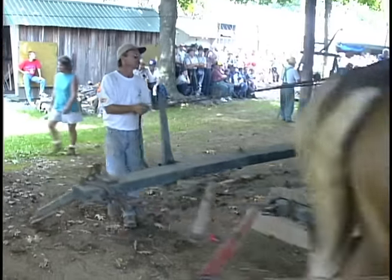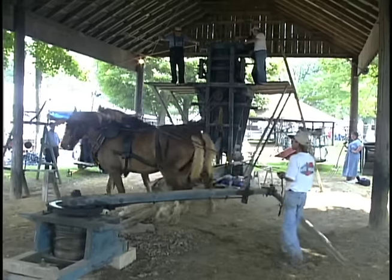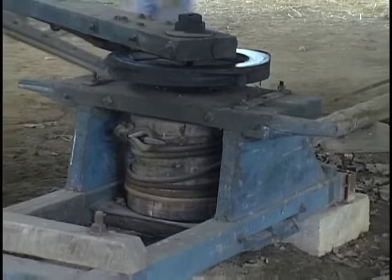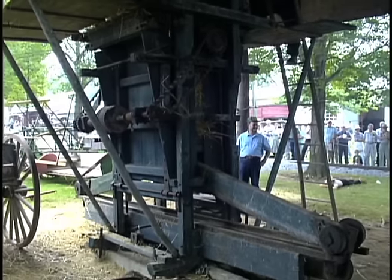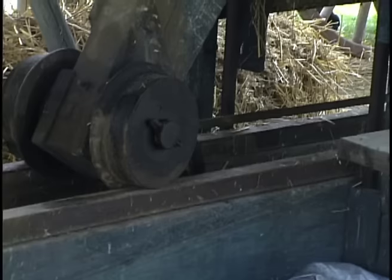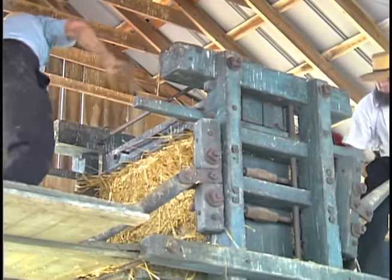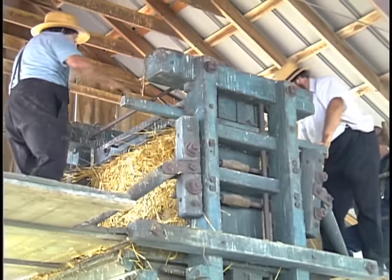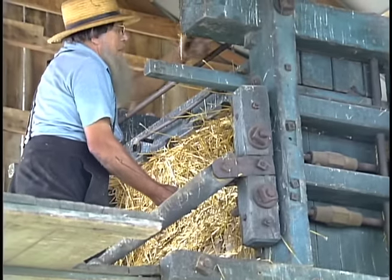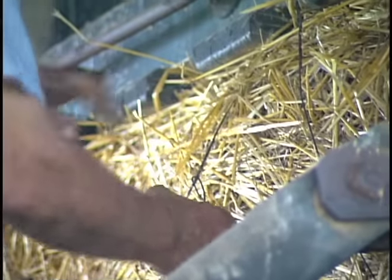Horses are used to wind up a winch that forces a plunger up into the bale chamber, compacting its contents. The brace they are trailing acts as a brake when they stop. Seven cycles completes the compression, and the doors are opened. Wires are passed through the head block and the bottom of the bale chamber and hooked on the other side. They will draw tight as the bale expands.